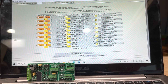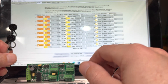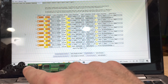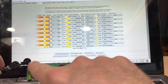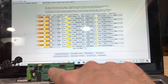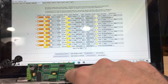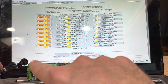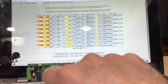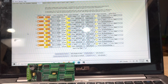I'm using two-headed masts, so one signal with two heads uses two of these outputs. The top head will be number one and the bottom head will be number two. Then my second signal mast: the top head will be number three and the bottom head will be number four. Each head gets its own unique address, and that's how JMRI can communicate with it to tell it what to do.